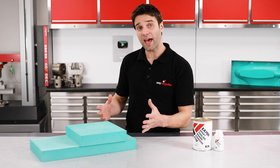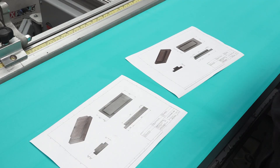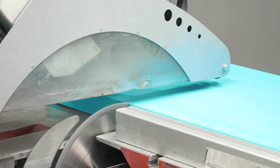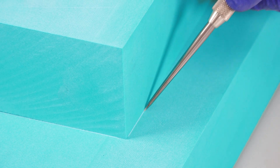In order to get these prepared, the first step in the process is to accurately and squarely cut the stock material. This is done on a panel saw based on some CAD drawings. Blocking out in this way allows for much greater efficiency, not only in tooling board wastage, but also in machining time compared to a simple cuboid stock.